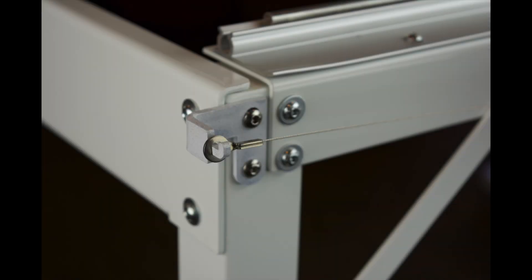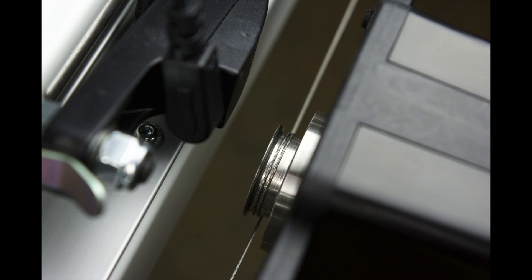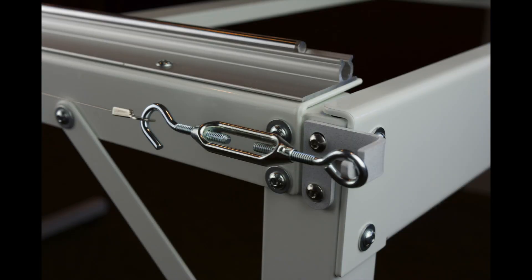Now we are ready to install the X-axis drive wire. Place one end of the drive wire on the drive wire bracket as shown. Next, wrap the wire twice around the X-axis drive wheel as shown — note that the wire enters and exits from the bottom of the drive wheel. While keeping some tension on the drive wire with one hand, place the hook end of the tensioner through the other eyelet, then place the loop or eye end of the tensioner onto the other drive wire bracket as shown. Tension the drive wire by turning the center barrel of the tensioner only — the hook end of the tensioner should never twist, as this will impart additional stresses to the drive wire and cause premature failure.